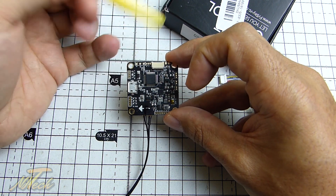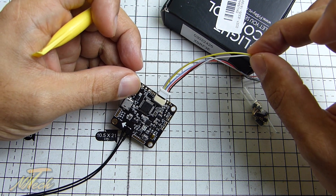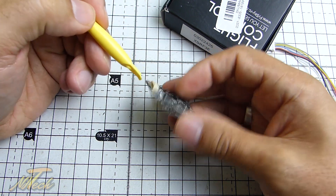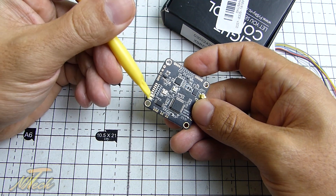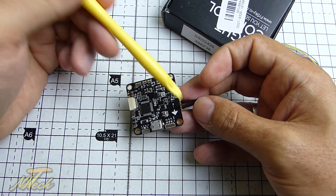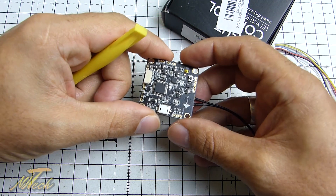So other things on here — there is a standard header, and they include a little loom for connecting up to the signal pins on your ESCs. There are six available there. If you flip it over, you also have micro solder pads, so it's nice that they've given you the solder pad option should you want to solder directly rather than use the header. You also have 5V in there, which will power the XSR. When you plug in the USB, it does actually power up — it powers up the XSR on board — so you can do your radio configuration without having to plug in the flight battery. It's only a little thing, but it does bother me when you can't do that on some boards.